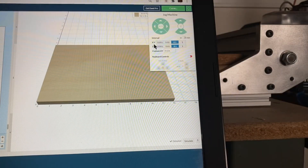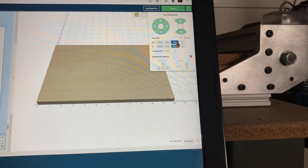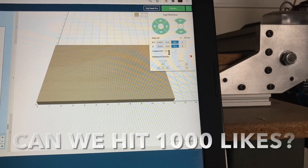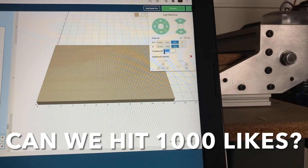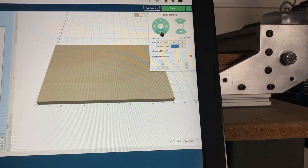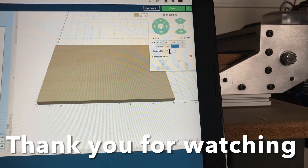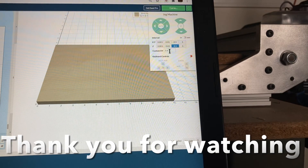There's a new feature added in Easel — it's no longer just one line here. We now have two lines: one for XY and one for the Z, so you can control the difference in height depending on the axis you want. And this is one I love: no longer do you have to move just one inch at a time. Now you can type in any amount — let's say five inches — hit the button and away it goes. That is absolutely fantastic and long overdue. I applaud the Inventables team for adding this, and I'll see you in the next one.